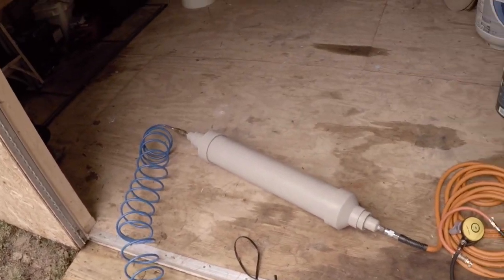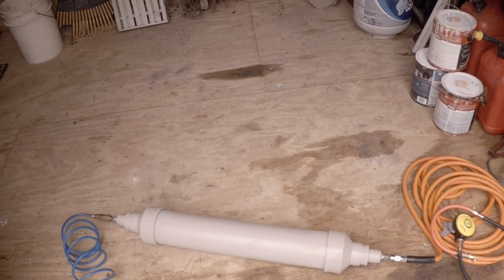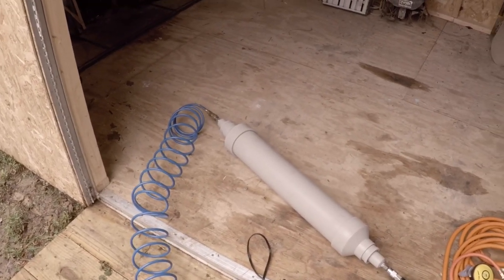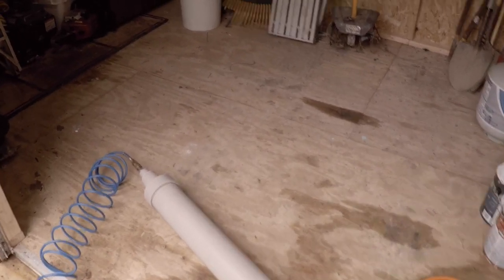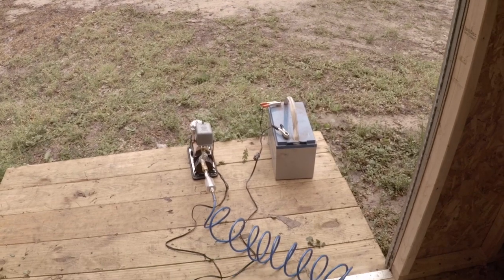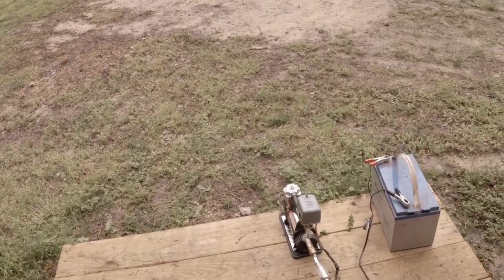The air reserve chamber is just four-inch PVC glued together and reduced down. I drilled and tapped the ends to make quick disconnects so I can break it all down really easily — makes it very portable. As for any fumes from the PVC, you fill it with Simple Green and hot water, push it through the system, and run it until there's no more moisture coming out. No bad smell, no bad taste, and the filter catches anything coming off the pump.